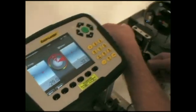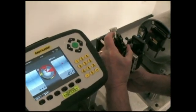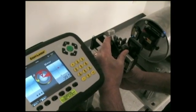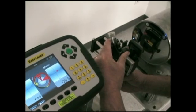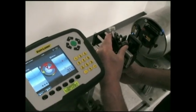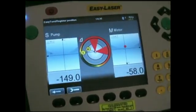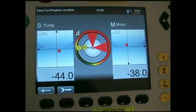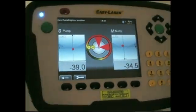Now I'll take my third measurement. You can see the S unit moving on the screen — it's coming around on the inclinometer until it's just past 91. Back a touch. Now I'll sweep my other unit around. You can see I basically need the M line sitting right on top of the S line. 86 — okay, I'm happy. I take my last reading.